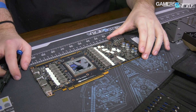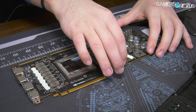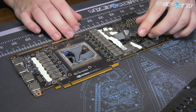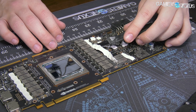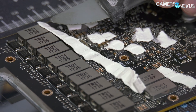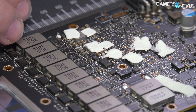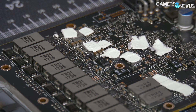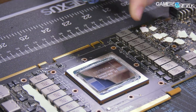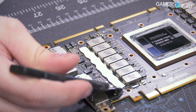Let's get a look at the PCB. There are a lot of thermal pads and we need to be careful removing them. I have spares I can put back on in their place. These are kind of like a cloth thermal pad — I've removed them by hand before and they're very easy to destroy, they just fray if you use your fingernails, so you need a really thin tool to get in there. We've successfully removed that. Also, is this more VRM over here? Yes — we have VRM over here and part of the VRM over here as well. Pretty interesting.